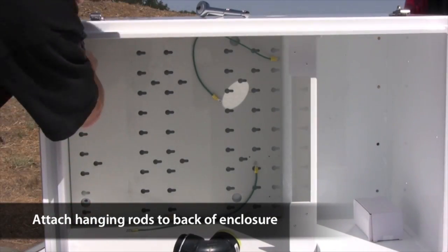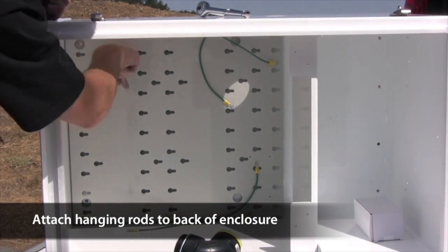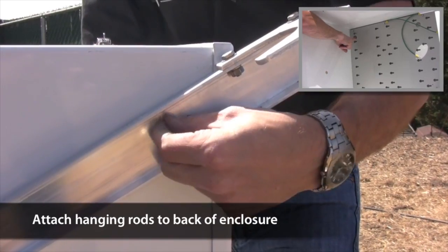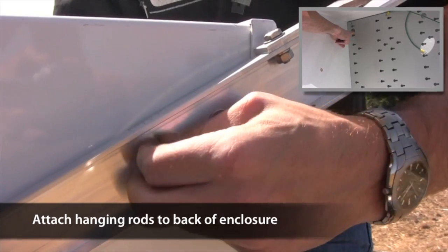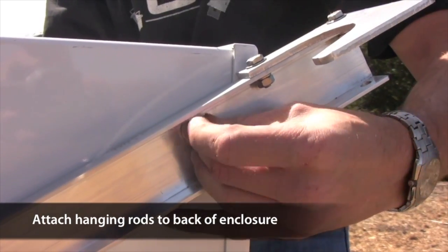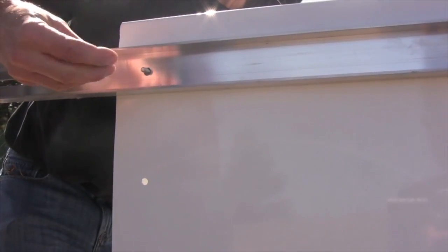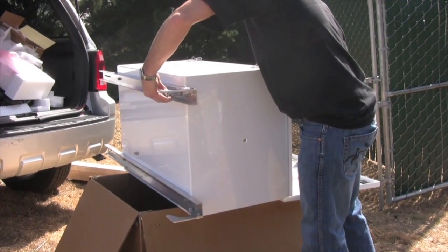Inside, locate the four holes that match the holes on the outside. Two of them are behind the keyway plate, which is what supports the data logger. Push the bolt through this hole and hold it, being careful not to drop it behind the keyway plate. It helps to have an assistant thread the nut on the other side while you hold it, but one person can do it carefully. Place the washer, then the lock washer over the end of the bolt before the nut, then tighten it up hand-tight. Repeat on the other end and continue with the second hanging rod. Finally, tighten everything up.